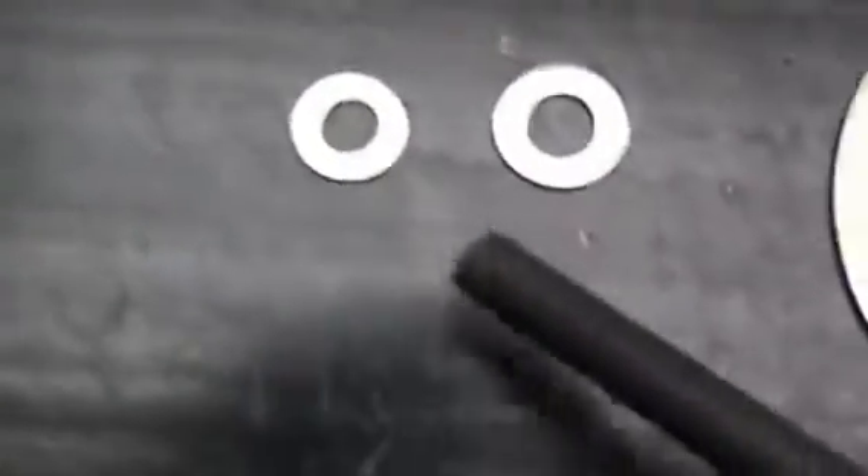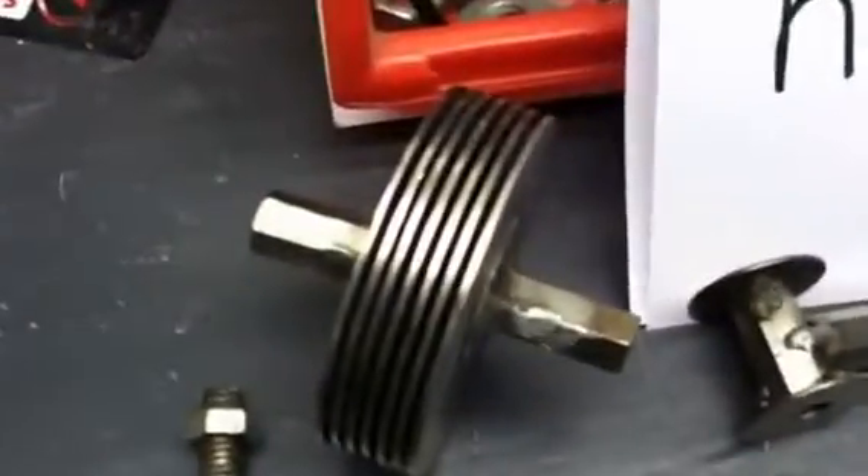This one is a little sloppy in there, I didn't like that. And this is the smaller washer, one size down — I think it was 5/16. You have to use this drill bit, which works really well. Put it in your vise, clamp it nice and tight, don't smash it or bend it, and one step punches out the 3/8. I don't want to take that much space up inside the plate area in the gap. The less area you're taking up in between the washers, the more surface area you have, and the more surface area, the more hydrogen. So this is the smaller one I'm using — that's what goes in between the plates.